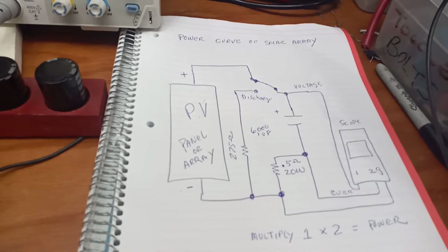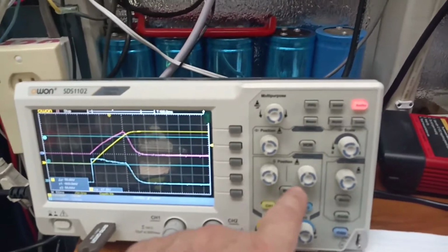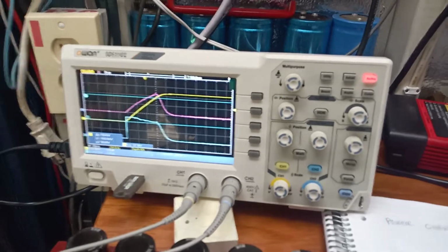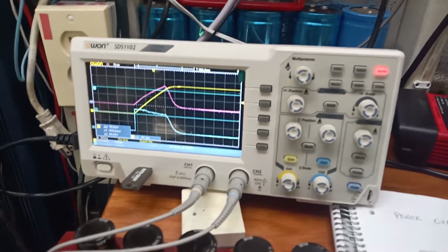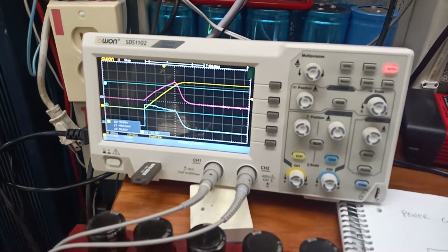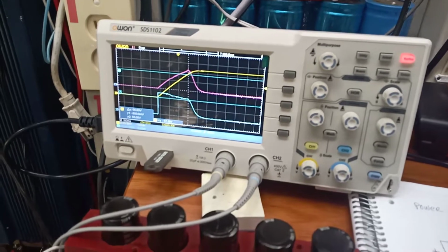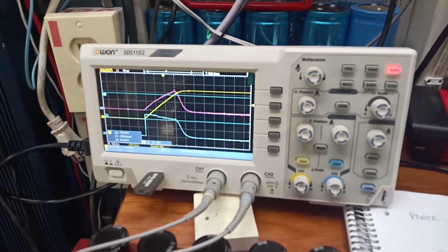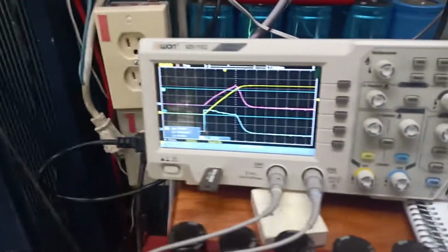And you can use a smaller capacitor. The time function will be shorter. You have a little button here that says math, and you can set up the math. On the more advanced scopes, you can, well, this one has it. You can either set in the resistor so it calculates out amps, or you can set how many volts or amps per division. But it's pretty simple.